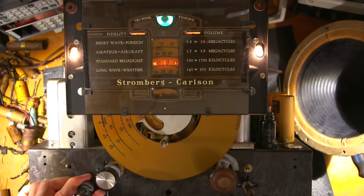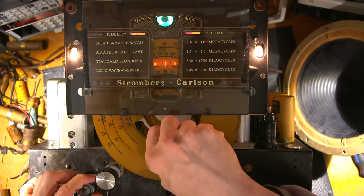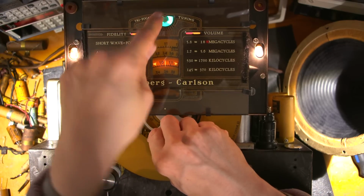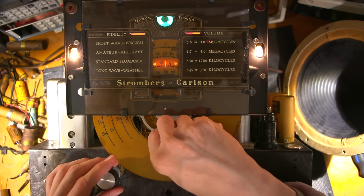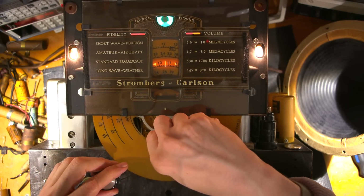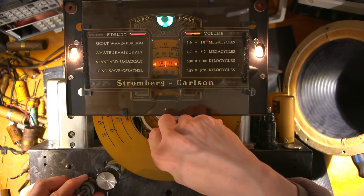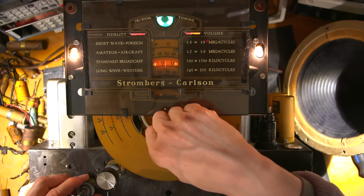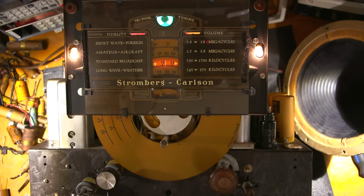so this is the bandwidth again. Let's see some volume. So you can see the eye doesn't really want to move all that much. Whereas if I widen it up, it's more sensitive when it's wide than it is narrow, which is kind of interesting. It's a funny hobby. So that might indicate that the IF is definitely out of tune. And of course the RF section in here might not be as sensitive as it should be as well. So that would cause this to be like this.